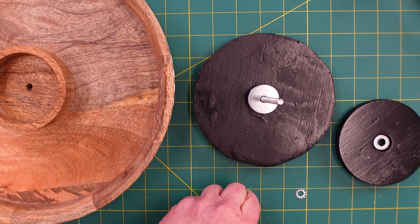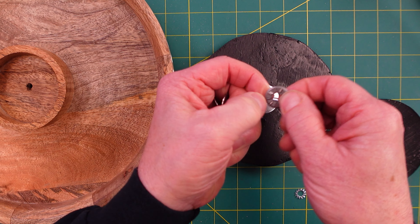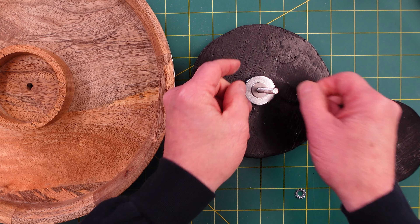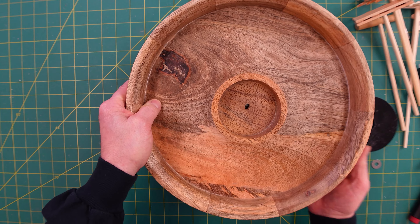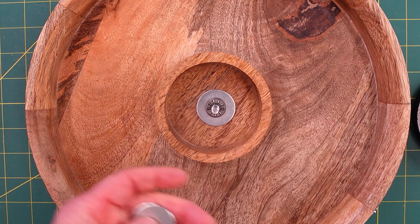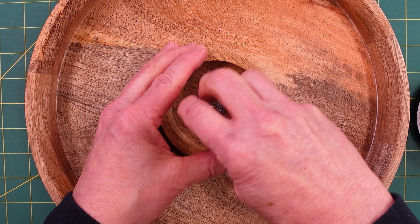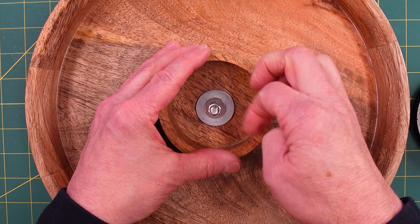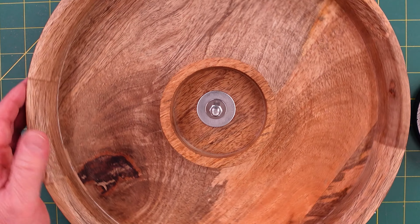The next thing I'm going to do is take one of those washers and put it in here, then take a roller bearing — I'll post down below in case you're interested. These are all just cylindrical rollers. Put this down in here with a flat three-quarter inch washer, then slide the hole on there. Another washer, another roller bearing — use another roller bearing on there. Three-quarter inch connectors, put that down. You could use different combinations, whatever seems to work for you. Tighten it down — it's hand tight and you can see it rolls pretty good with a little bit of effort.